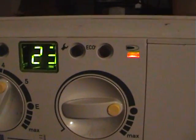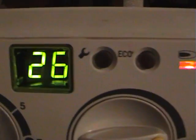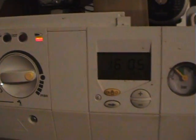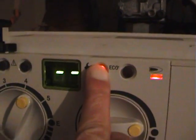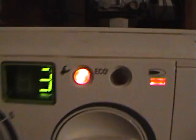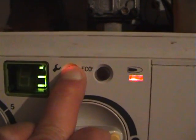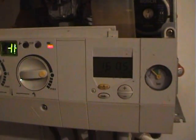The reason it goes slowly to start with is because the boiler is filling up — it's purging the air out. Right, so that's that. Now if we go to the same service mode again, it's on 3.3 still because I haven't moved the control. Can you see it's on number 3, where it should be? So there's your fault confirmed. Turn the control back again to where it should be, and it's working perfectly.